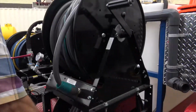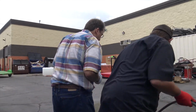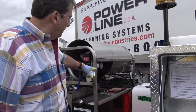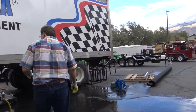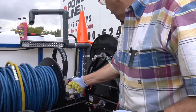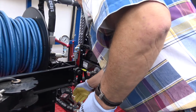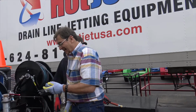We do the same thing on the washer hose. Okay, we're gonna go ahead and turn it on. Let's go check our antifreeze level. Keep $50 worth of antifreeze with you. It's absolutely worth it. We already know we're antifreezed up into the coil and back to the easy start valve. So it'll have to run for maybe 30 seconds. Okay, so we're off here, on with this hose reel, and we're on with the flow coming up and over here, because it won't flow anymore here. It's gonna flow this direction. Path of least resistance. Okay, one click.